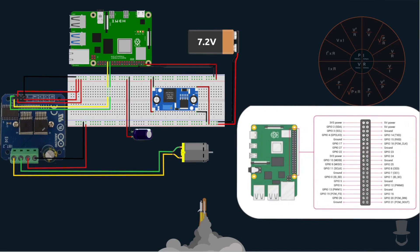This is the actual H-Bridge I'm using. You don't have to use this one necessarily, but every H-Bridge is going to be a little bit different. The way mine is wired up, I need three 5-volt inputs on the actual bridge — these three right here — and it goes over to this 5-volt rail. This is the actual ground pin that you need to tie into the rest of the grounds, and the PWM signals come in on these two outer pins right here.